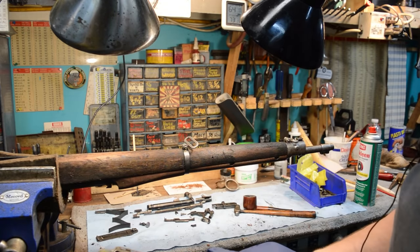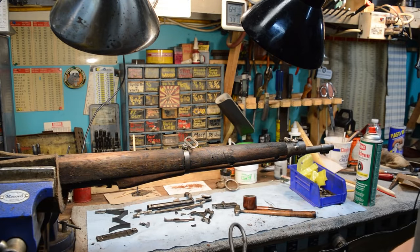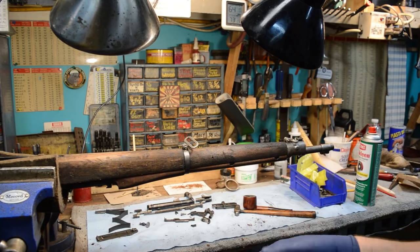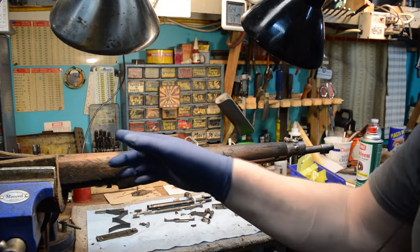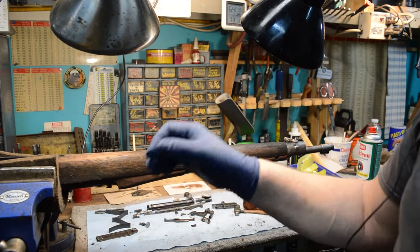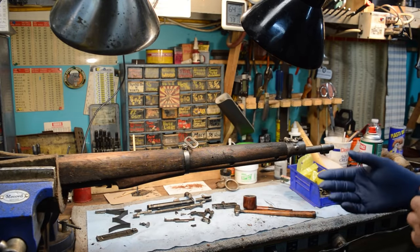There's a theory we were bantering about in the shop yesterday about whether or not the lacquer thinner would make it easier to reinflate the wood pores. Bruno's operative theory, and the one I'm gonna run with, is that by removing the oil, the water now has access and can reinflate the cellulose part of the wood fibers and blow this all back up.